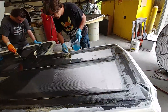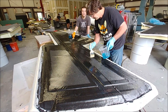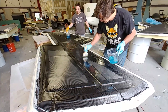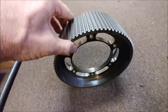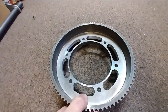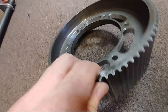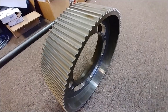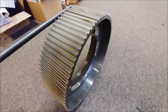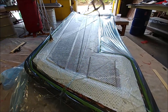Jeff and Devin are laying down the second round of layers on the lower left wing skin, and in the background there's the lower right one with the material laid out — it just needs to be wet down and bagged. They're getting these finished for the week. Meanwhile our new aluminum pulleys with a few extra teeth arrived on Friday — 89 teeth now — giving us a 1.58:1 reduction on the drive instead of 1.43:1, so the engine will rev a little higher and the prop will turn a little slower.